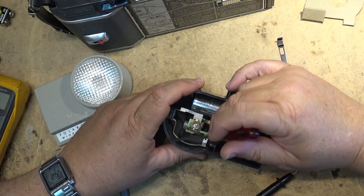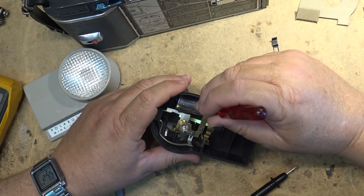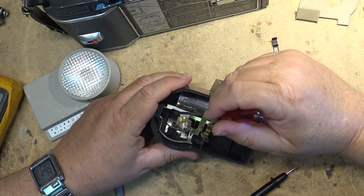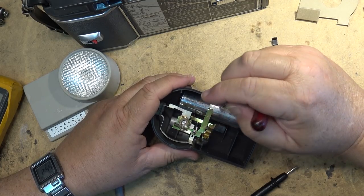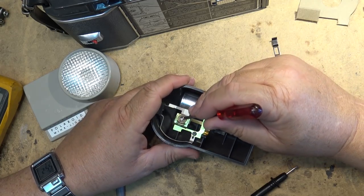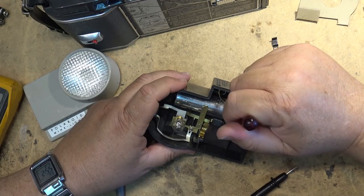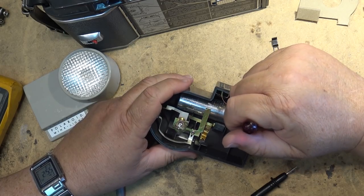It'll also flow through the flash bulb itself. It's not going to have enough current to fire the flash. You're going to have some current going through the little filament that's part of a flash bulb that ignites it, but you're going to have most of it going through this little light bulb here as the capacitor comes up to charge through this 1K resistor.